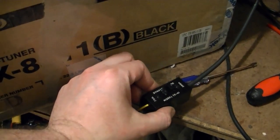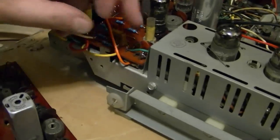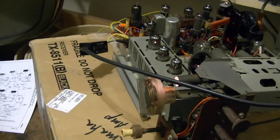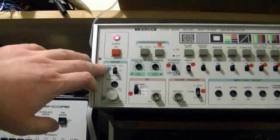I've got an output cable going, right now hooked up to my scope. I'm using the output pad from the 415 — you can select the output impedance to be 300 or 75 ohm. I really don't think it matters for what I'm doing. I want to inject a signal right to that green point there. So I'll hook that up, fire this up, and let's see what we get. Just waiting for the set to warm up. The generator can do sound — a one kilohertz test — but that's about it.